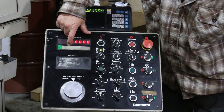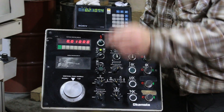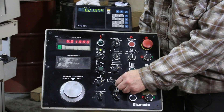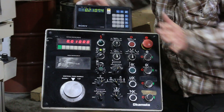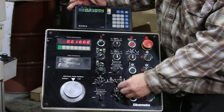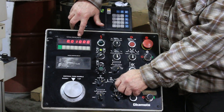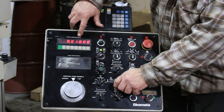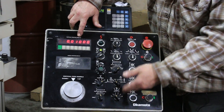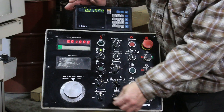I'll reset this. Let's say I want to take off 10,000. We're just touching the workpiece now. When we start to feed — now this is going to be a plunge grind. I'm not going to have the saddle going back because I want this to go quick. We're going to feed down 1,000 at a time until we get to 1,000 before zero, and then we're going to start feeding at 1 tenth. All those values can be set on these switches here.